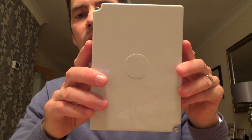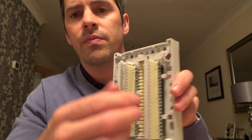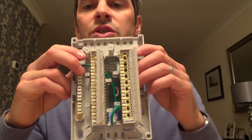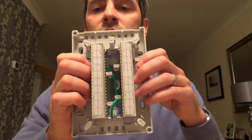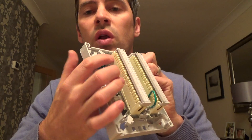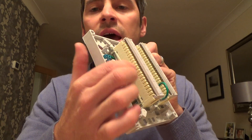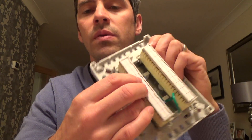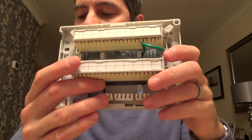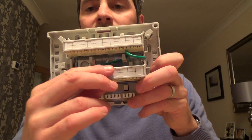So it's yeah, it's this one here — Boxcon. Now if you have a look, this particular one is fully loaded. You can get them loaded and not loaded. The ones I sell in my eBay shop are fully loaded. If it's not loaded, the strips you need to buy are called Strip 237A. And if you need to get these little label things on top, they're called Strip Designation 51A.